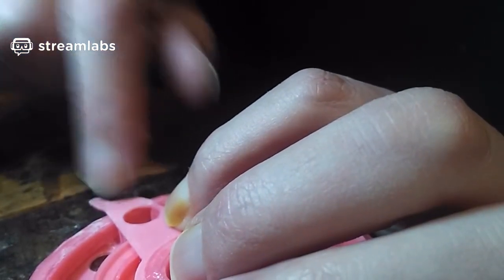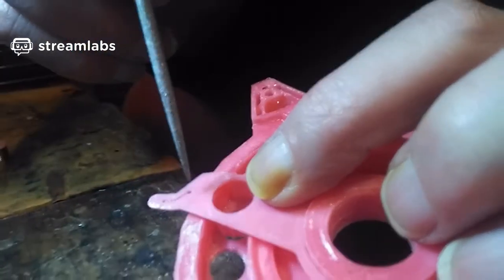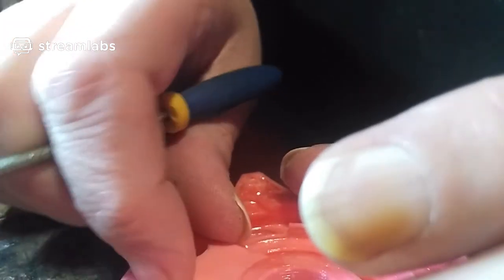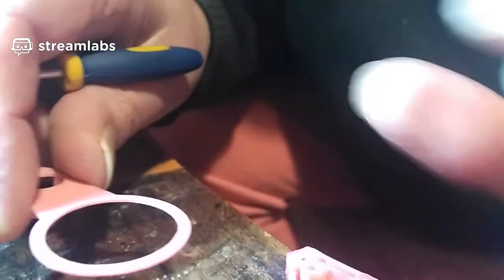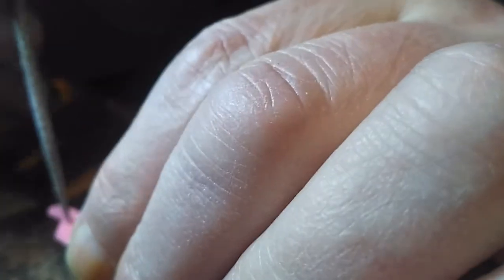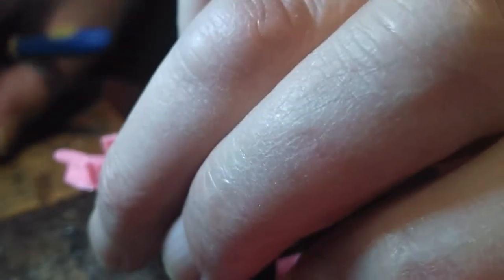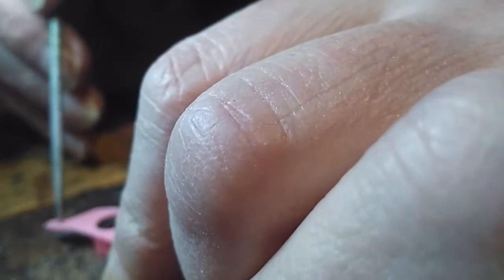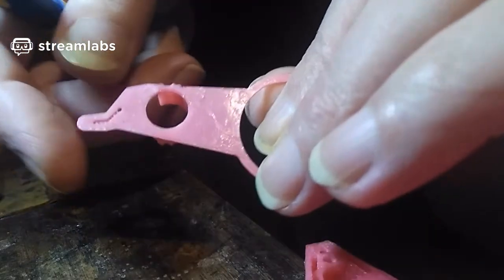If I get my coil holder — there's something I designed into this because the coil is going to be moving. I made some little grooves. There's a little groove that runs through here and a hole that goes all the way through the other side. The idea is that when the coil is fitted, the wires are routed through this little groove, come out the back, then run up to the very tip of the lever. The wires terminate at that point where the lever comes out, so the wires aren't going to get caught in the mechanism.